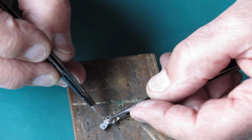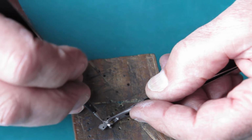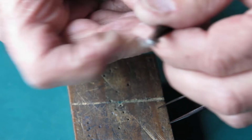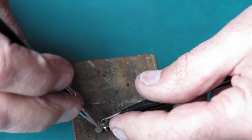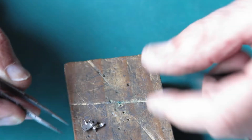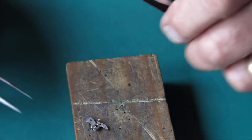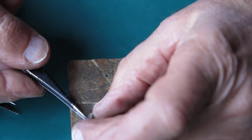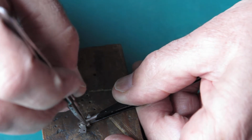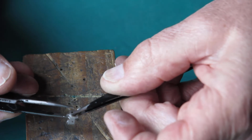Now this spring which is here, I've got to hook it round behind that post. It doesn't want to go. Let's try swapping my tweezers over so that I've got my finer pair ready to get to that spring. So this is rotating in my tweezers, the whole thing is shifting. Now it's come apart. Got to put it back together again. The parts are quite slippery. Okay, I've managed to lift the tail of that spring over and hook it behind that post.